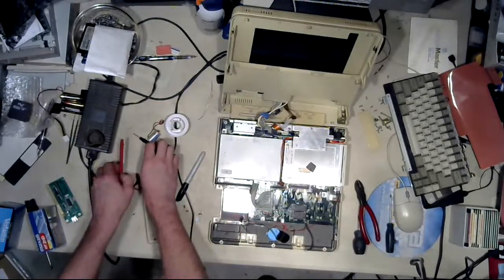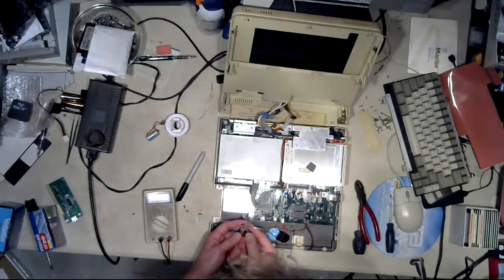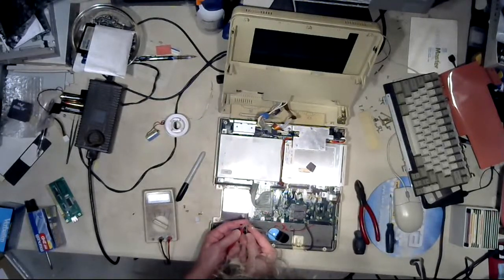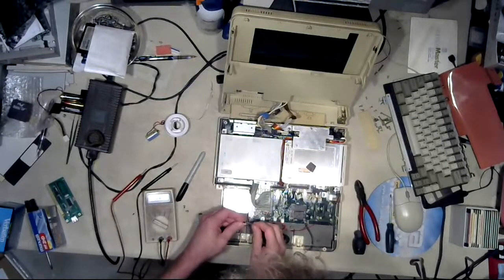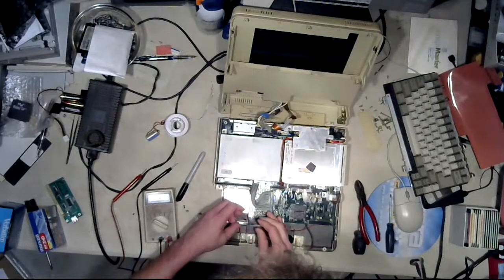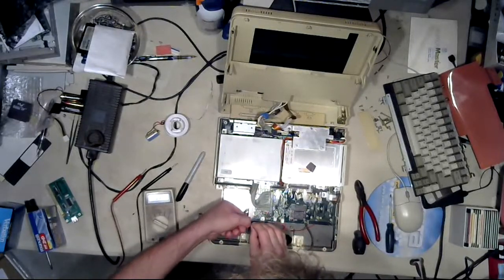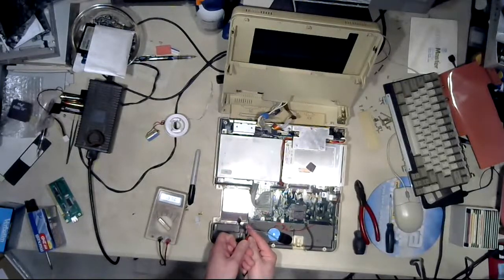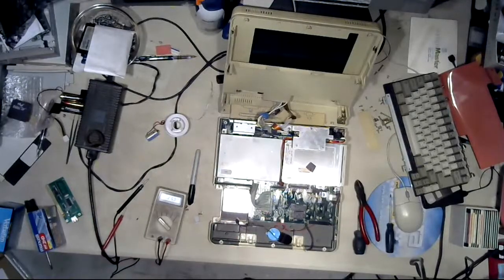All right. So if I do negative, positive here, I'm getting 3.25, and here I'm getting way less. Great. Okay, so let's try to put that in the other way. Okay, let's try that. I'm getting, yep, 3, and then after this I should be getting 3 volts. Okay. Maybe the avalanche current on this isn't as bad as I thought. Okay, good. So we're going to go ahead with that.